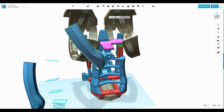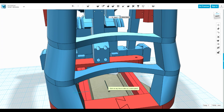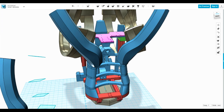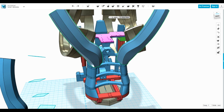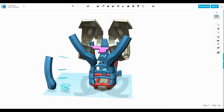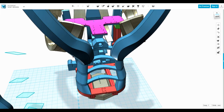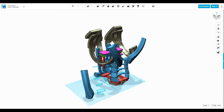I've only ever drawn half of this and then used the mirror tool to make the other one perfectly symmetrical. All you need to do is select the object, select mirror from the pattern menu, select a mirror plane — I've got a little sketch floating right down in the bottom which is right in the middle — and if I click on that, the other one appears. You can do that to any of the parts to make everything symmetrical, in any plane — left to right, back to front — as long as you've drawn a sketch line. That's been there since the beginning of this project to make sure everything works out symmetrically.